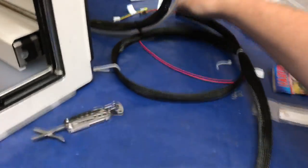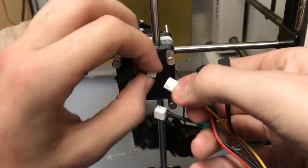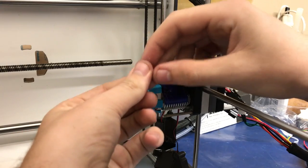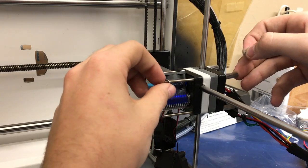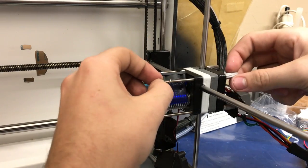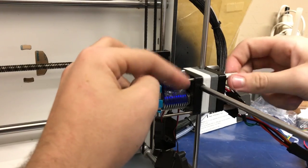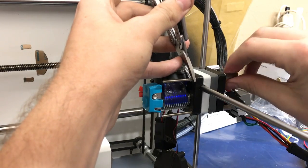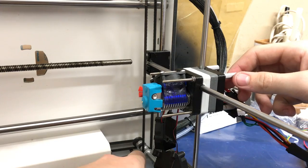Now take your wire harness — it has two ends, that end and this one right here. This other end has all the connectors, so we're just going to connect those up right now. For this part, you want to take a washer and put it onto one of the M3 screws, then take a nut and add the nut on. Thread those all the way up until it's tight, then take a pair of pliers and tighten that down. You want to make sure these are tight — this print head is going to be moving around, vibrating, etc. Repeat this process for the other three screws.